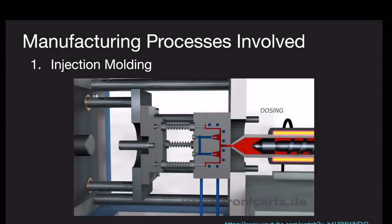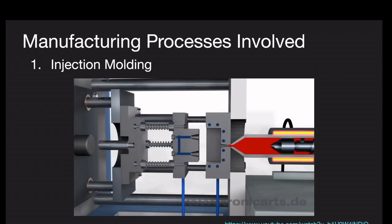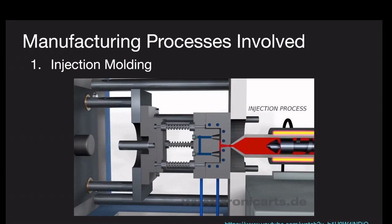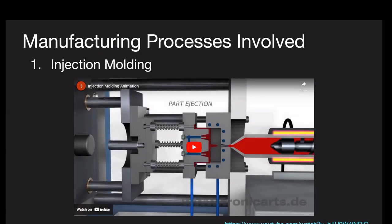Polypropylene pellets are fed into an injection mold machine and pushed into the mold after being melted by heating coils. The liquid plastic fills the gaps of the mold as air escapes through tiny air vents, and then the plastic solidifies as it is cooled, pushed out of the mold, and then the process repeats thousands of times. And this is how the paint palettes that I currently use were manufactured. And I've designed the EZMix Watercolor Palette so that it can be manufactured the same way.